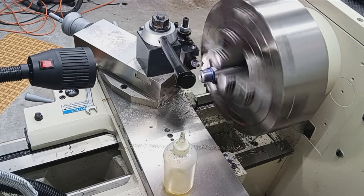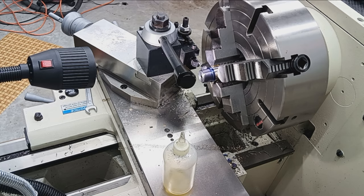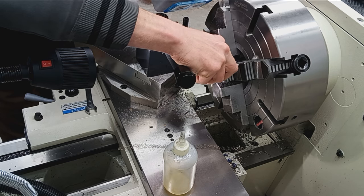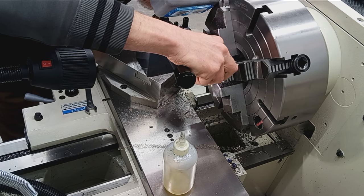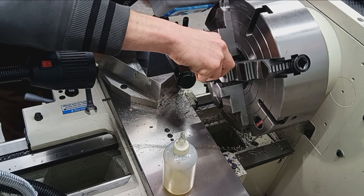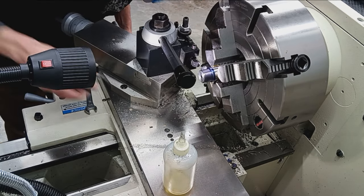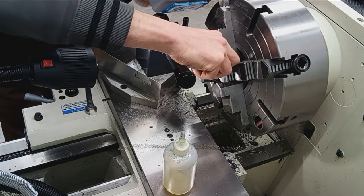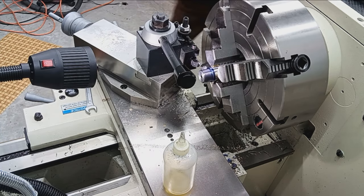Okay. Now I'm gonna switch out to my magnifiers again. The older I get, the worse my eyes are. I'm going to check with our thread pitch gauge. And we're lined up exactly, 28 threads per inch. It looks like a nice fine cut. It feathers out real nice right there. So, everything's set properly. So we'll just proceed to cut this down until the receiver fits on.